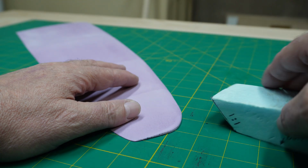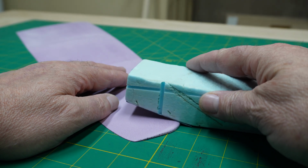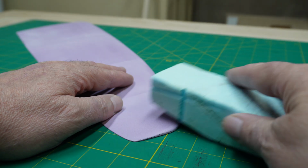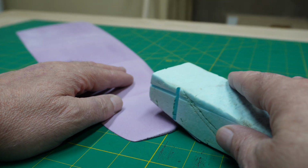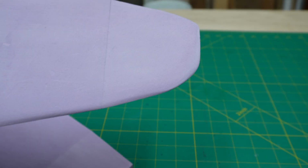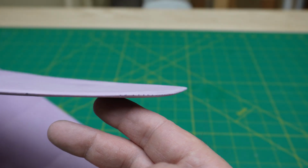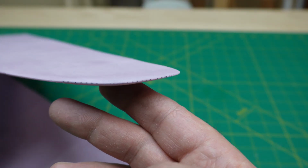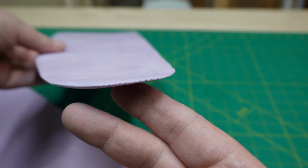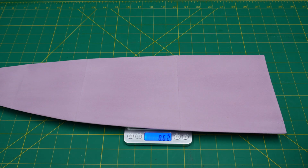I left a PDF in the files in the description of this project down below, so you can take a peek if you want. Basically how you use this is you start with the 1-to-1, then you move to the 4-to-1 ratio, and it gives you a very, very nice thin tip. As you can see, it's nice and thin. All the witness marks are still there, so we still have the same shape as what we started with. With that, we are done with the sanding on these cores.